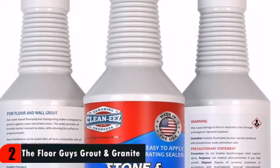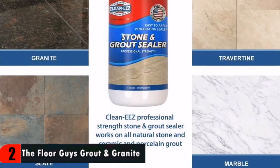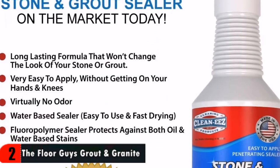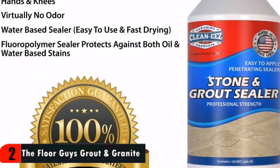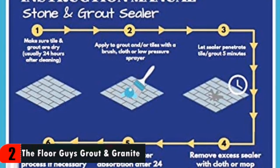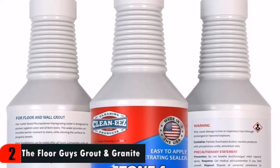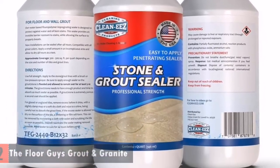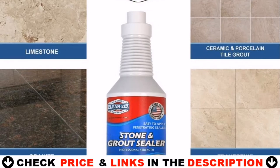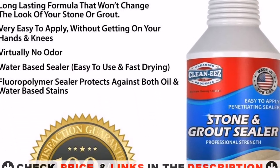This worked great and was easy to use to seal the grout for my new floor tile in the kitchen. I ordered a bag of 1-inch foam brushes, and it worked out as well as I could have hoped. The foam allowed me to keep going over a good distance without constantly recharging with more product, and also kept me in the grout line very easily. When I did get out of the line, it wiped off easily with a cotton rag. It only took a few hours to apply two coats to about 160 square feet of floor with 6-inch by 24-inch porcelain plank tiles. I kept the windows open and ceiling fans running, but didn't notice any odor. I had a ton left in the quart bottle and could have easily used the pint size.